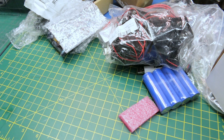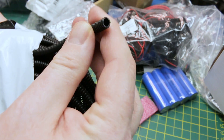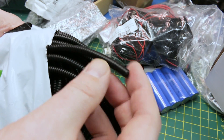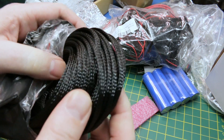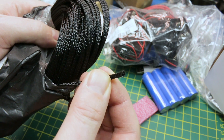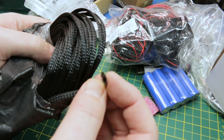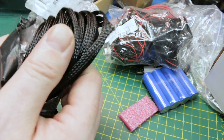Click a thumbs up on this if you like these videos. In this package we got a whole bunch of split loom - just wire loom for robotics projects. I'm going to use this in the big robot just for cable management, to keep wires under control. You can route the wires through this split loom. In this bag, yet another different way of doing it - this is stuff you see on 3D printers a lot. It's not split, you have to fish them through. It's more of a plastic nylon, woven and really flexible, really good for wires that are moving a lot to keep them from breaking or pinching.